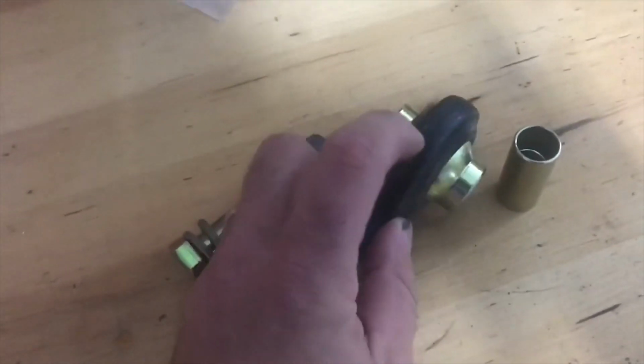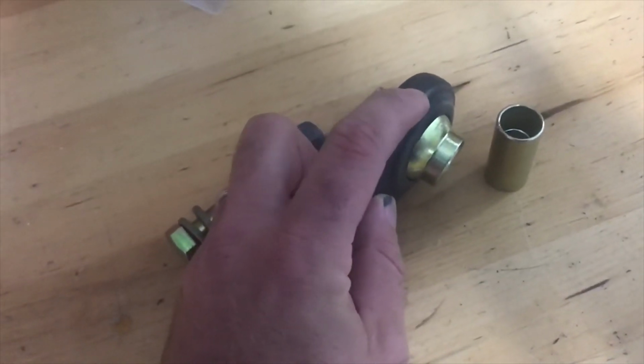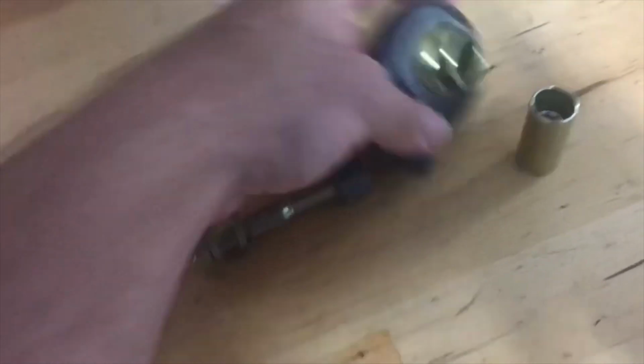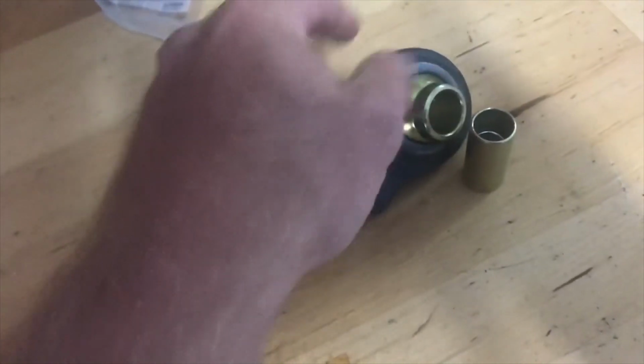This is not. I might see if this goes on the tractor and it holds, and I might see if I can drill and tap this and put a greaser in there to make it greasable. That'd be nice, but I'm not sure about that metal. It almost feels like cast, but it's not. It says it's forged, so it's not cast iron. Anyway, I'm going to whack this other end off of here, and then we're just going to weld that eyelet on. So let's get after it.